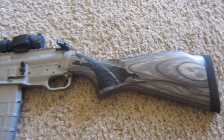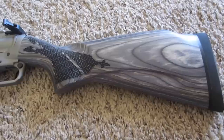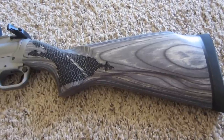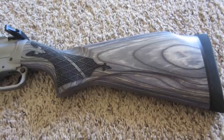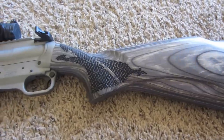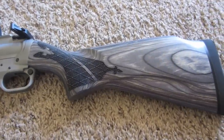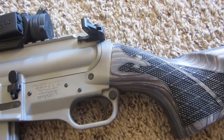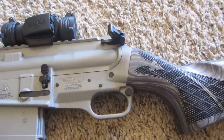I had a little bit of work to do on the back of this stock. The hole they drilled through it — they drilled one hole from each end, and where they met in the middle it wasn't quite lined up. So I had to take a 3/8 wood dowel with some sandpaper on it in my drill and run it in and out to get the buffer tube to slide in there. A little bit of fitment in the front too — I think the hole was 5/8 and it needed to be 3/4 to fit this gun, so I had to do a little work on the front as well. But overall it was pretty easy to put on there.